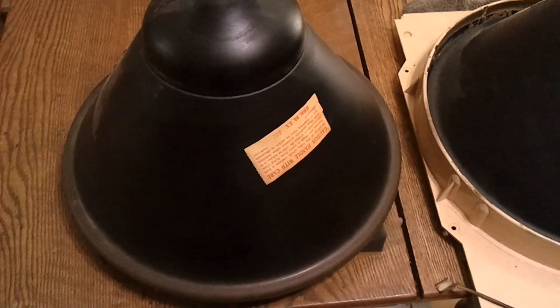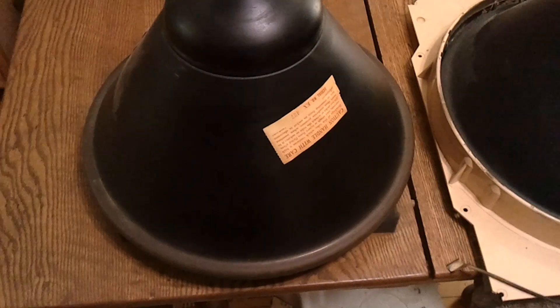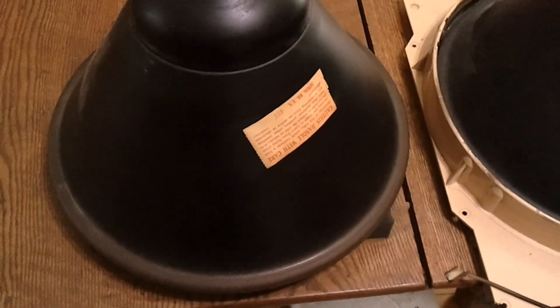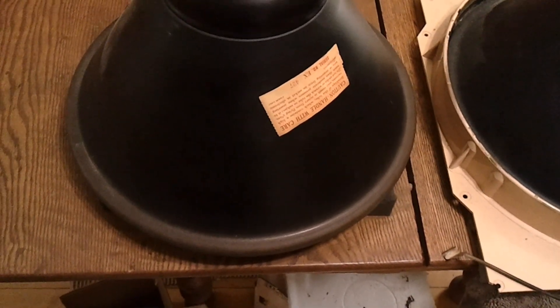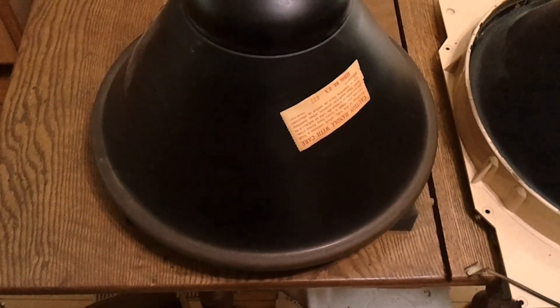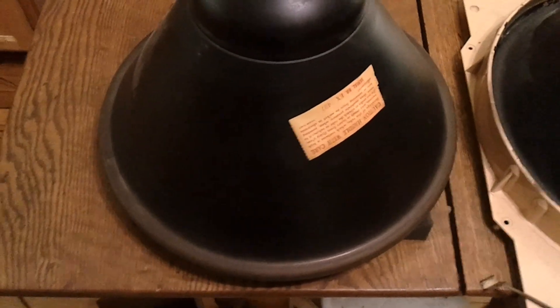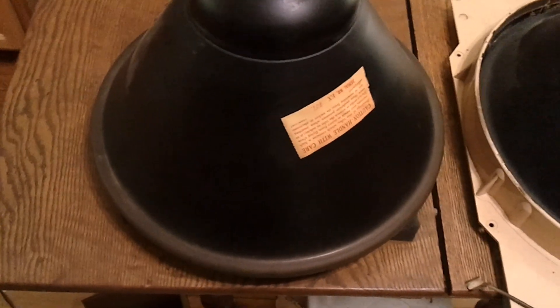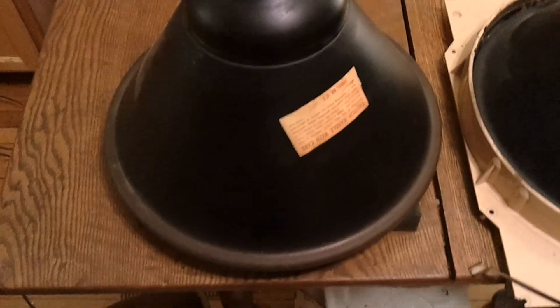In the case of this tube, I think it's around 12,000 to 14,000 volts, so as you can imagine, pretty dangerous to be around. I've only worked on one of these sets so far — a 19 inch set — and whenever I would turn that chassis on the workbench and get anywhere near it, all the hairs on the back of my hand and my arms would raise up and start tingling. Very, very scary to be around.